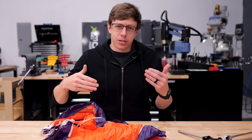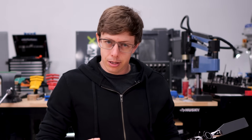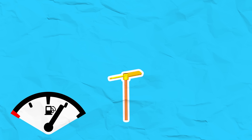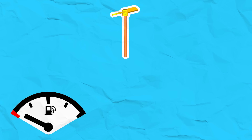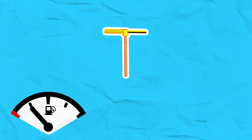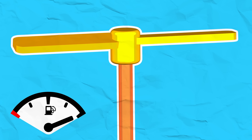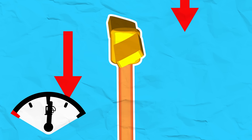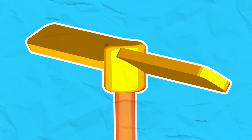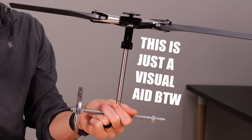I went pretty far down the rabbit hole of a pyrotechnically deployed parachute — basically shooting it out of a cannon to get it away from the blades quickly — but you can still imagine scenarios where it wouldn't work, like tumbling and shooting it straight down. So I decided on another strategy: autorotation. When the helicopter tops out and runs out of energy, you reverse the blade angle, and air blowing past them as it descends spins them like a windmill, refilling our kinetic energy fuel tank. Right before hitting the ground, you flip the blades back to generate thrust and slow the descent. This is what real helicopters do if their engine fails.